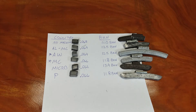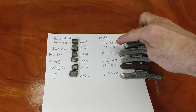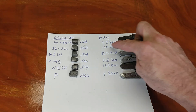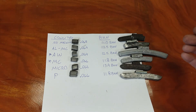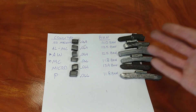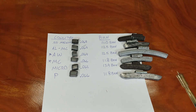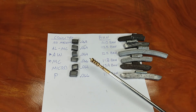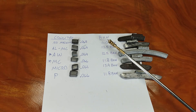But what we do see is there are variations. Does this mean that an ALMC wheel weight is always going to be 12.5 BHN? Absolutely not — because of lot-to-lot discrepancies or variations, just like with our powder, just like with our primers. This lot might have all been 12.5, but then once they filled up their smelting pots and everything else, turned out that next set was 13.4. This very small sample should only be used to give you an idea that there are differences. The amount of difference may or may not mean something to you.